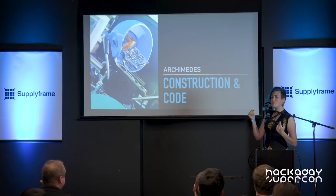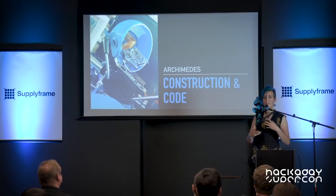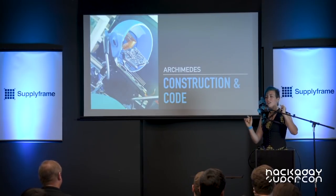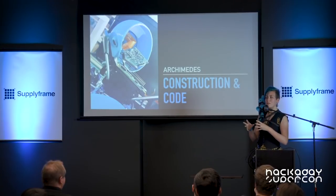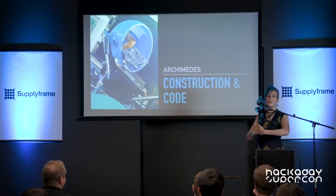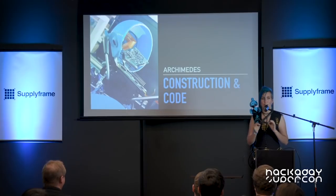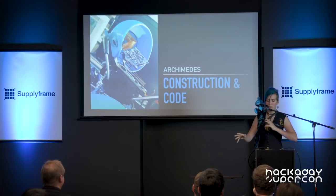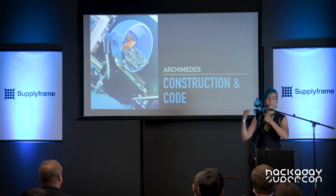I tried to make the Joy Detection demo natively control the servos at the same time so that you could do face tracking and whatever. However, I'm not good enough with Python — I can get the servo demo running and the Joy Detector working, but I think since they may share GPIO pins, which I think is obfuscated in the code and you can't tell just by looking at one file at a time, it wouldn't work. So I have an Arduino Maker 1000 controlling the servos separately.